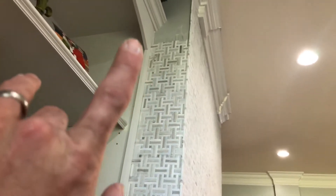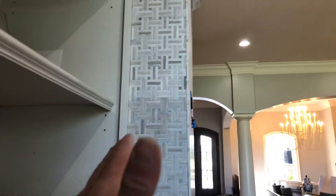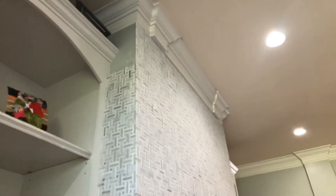You cut the woodwork with an oscillating multi-tool — this little tool right here. That way you cut your tile into an L-shape so it fits back behind the wood, and when you look at it from the side, the tile sits behind the wood trim. You want to do that for your crown molding too. For the top piece I'll let it run as a whole sheet and cut the sides into an L-shape, giving the illusion that it goes all the way to the wall.